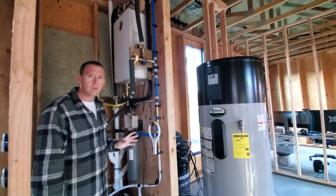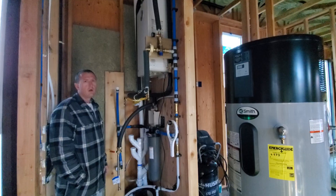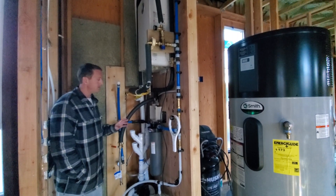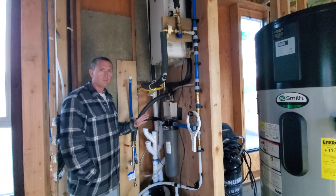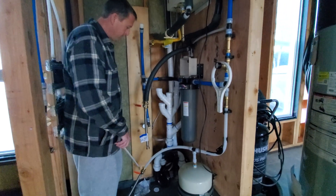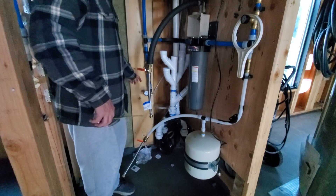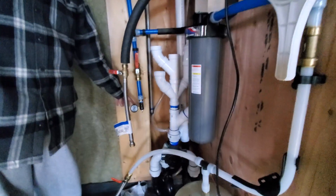Let's get in here for a closer look and talk about how we made all this work with the water heaters. Starting with the cold water — it's eventually going to pop through this conduit from underground. We haven't done that yet. It's going to come up here. This is the pressure test since we have it under air, making sure we don't have any leaks — so far so good.